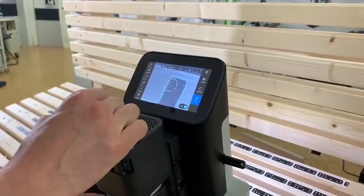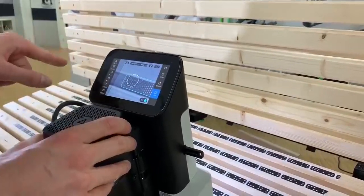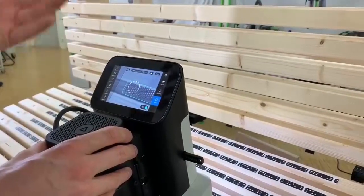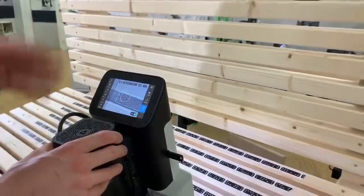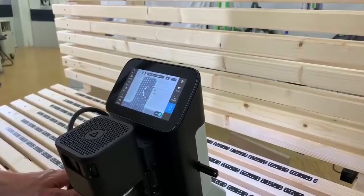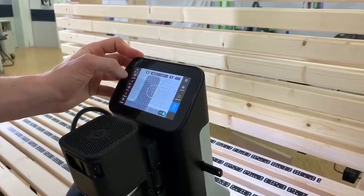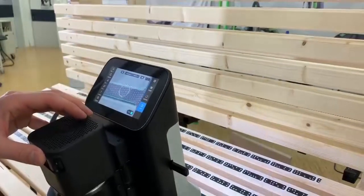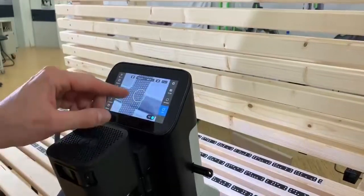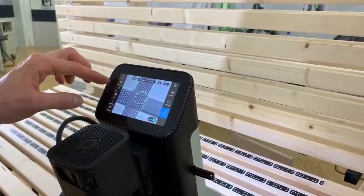Do you have to do that for every single letter, or is it just for this case? No. I think in this case I need to do it for every single one. What you usually would do if you have a bigger job, you would open it on, let's say, an iPad or a computer, and you can color code it. So depending on the color you use, everything will change for you. Yeah. All right. Actually, I'm wondering if we could go in here. No, let's do it like this. So we optimize this design for a 3 millimeter cutter, so let's not change anything on the fly. And you can see this little gap here, which we're gonna remove with the 3 millimeter cutter at the end. All right, so let's dive right into it.